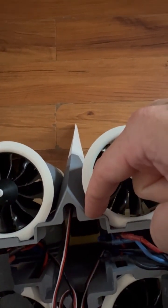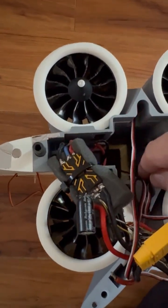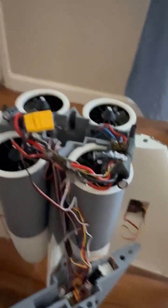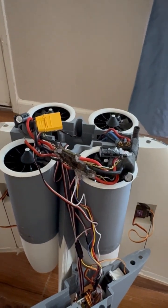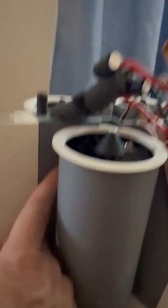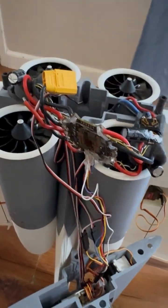I think what we're gonna do is get up on the airfoil and port it through here — I gotta get air in there somehow, other than the ports I'd already put. Just for the sake of getting it in the air and making sure the ESCs are cool, I might just poke a hole through this area and tuck the ESC here and one here. It won't mess with the aerodynamics too much. Then the power distribution board in the same place, just run those wires through here underneath this nacelle — and look, there's an opening already.